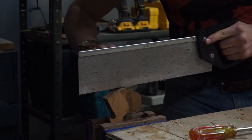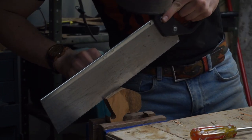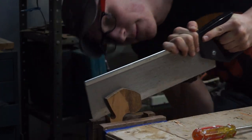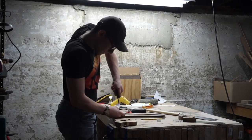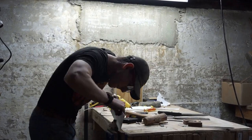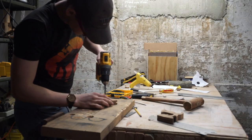Making this cut for the handle was a little bit easier using this saw, because it's a rip cut saw and I later filed it to be a crosscut saw. It just suited my needs a little bit better as a crosscut saw. Here we're just doing some final refining to make sure that the blade sits in the handle nice and straight and perpendicular, so we can make nice straight and perpendicular cuts.